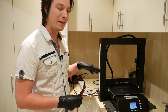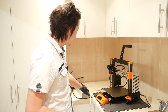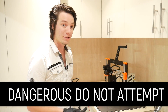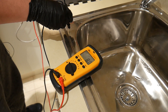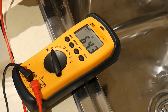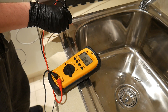So that's the JG Aurora A5 displaying a bit of voltage. I'm going to plug in the Mk3 and show that it's doing basically the same thing. I'm going to turn it on — again, these machines do not have ground; do not attempt this. In their current state they are functioning normally, but if ground is not connected it can become very dangerous with mains voltages. Touching onto the frame and onto the sink, we're going to see a voltage very similar to what we saw before — about 80 volts AC. Touching the power supply as well, we see about 90 volts — about the same as the JG Aurora A5. This is the Y capacitor causing the voltage.